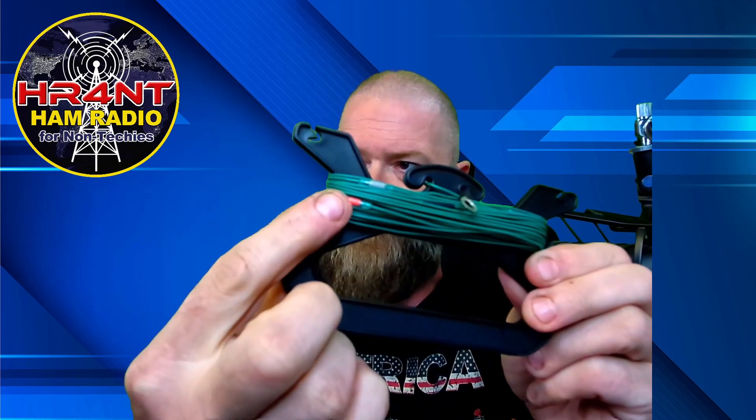When you get the Buddy Stick Pro, you get this wire assembly set up for the counterpoise. You've heard other people talk about the color-coded beads or bands for whatever band you're trying to tune to — by lengthening or shortening this wire you're able to tune it and kind of hone it in. But you need a decent antenna analyzer to do that.